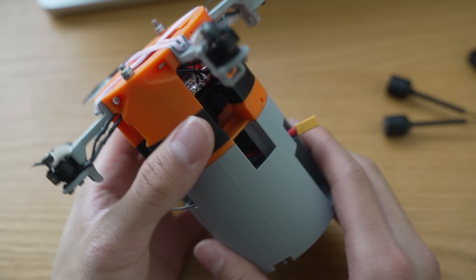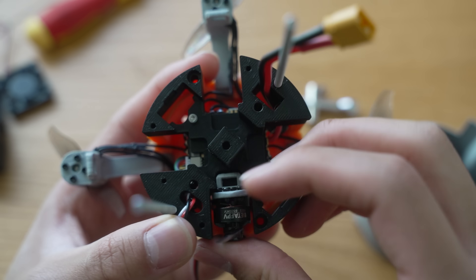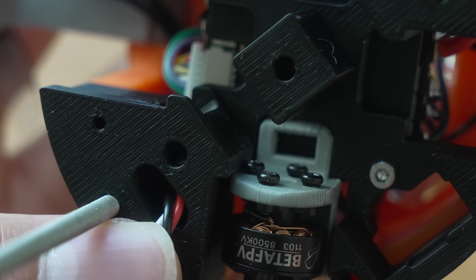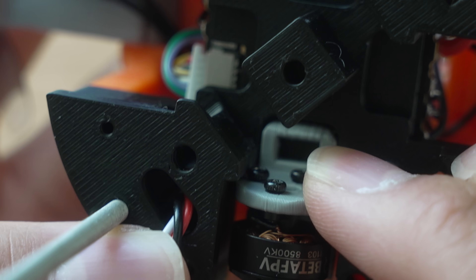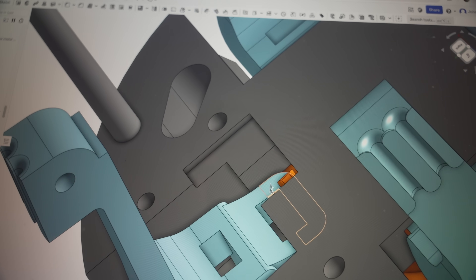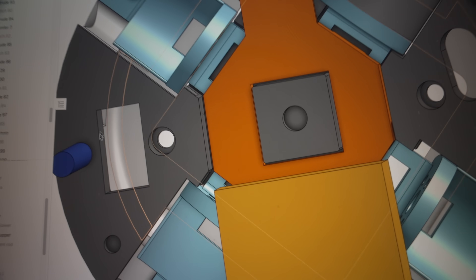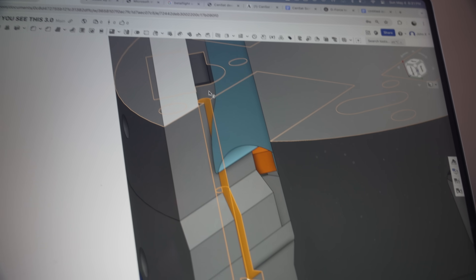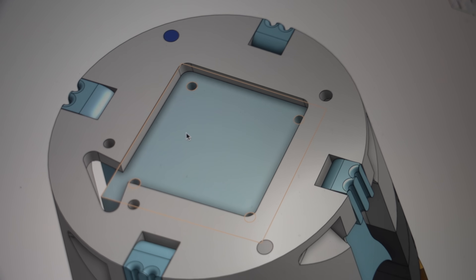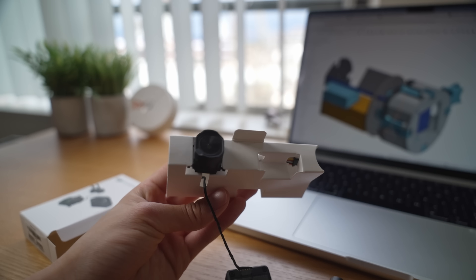We're still far from finished — there are a lot of tiny things we need to change. It was only after I added the motors that I realized the screws rub against the walls and cause too much friction for the arms to open, so we need to make some room for that. We also need room for a plug, a capacitor, the wires that go down, the camera cable, and a fan on top because the video transmitter tends to overheat.